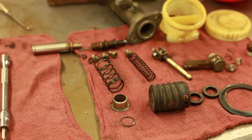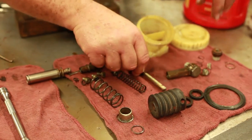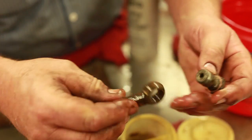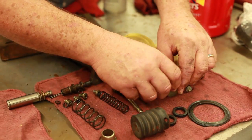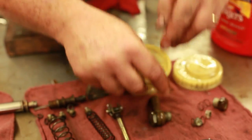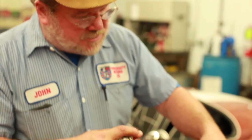Here's our big banjo washer that holds the rear fitting in place, and here's another valve. Here's some washers — which begs the question, where are the two washers? There's a copper washer here but there's no copper washer on the other side. These banjo fittings have to be sandwiched with copper washers — must be. Now if you want to make this thing look kind of pretty you can use some carburetor cleaner.